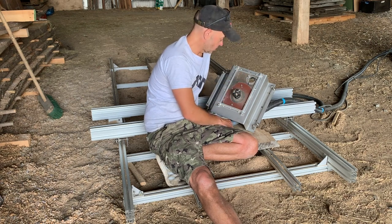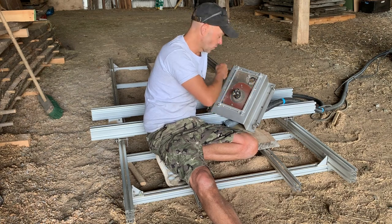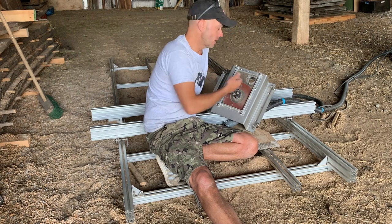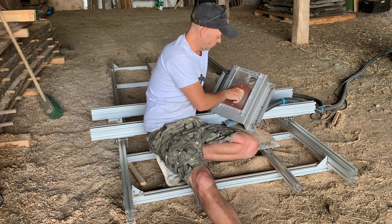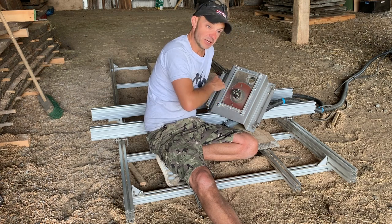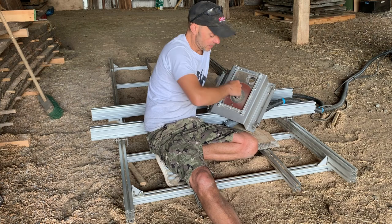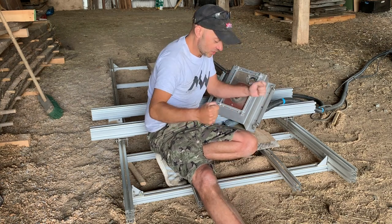Because for the convenience, I would really like the bigger hole. But all in all, I've got to say, it is absolutely stunning, really easy to use. If you've noticed, when I'm walking down, because we're cutting lengthways and we're not doing a cross cut, I'm hardly feeding it. I'm just resting my hand on the pole, pushing through. The router, the way it's cutting, is self-feeding, and then I drag it back, move it over 150 mil, and then go again. Really easy to do.